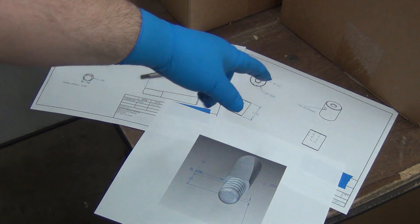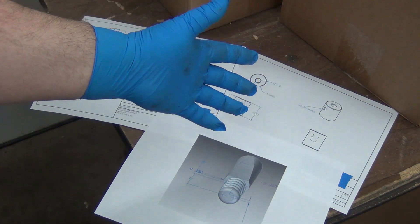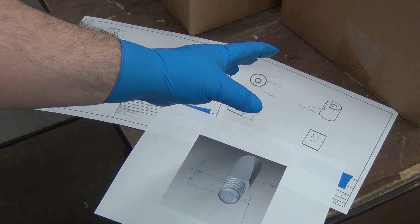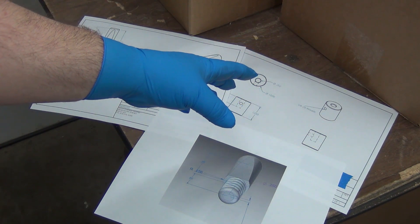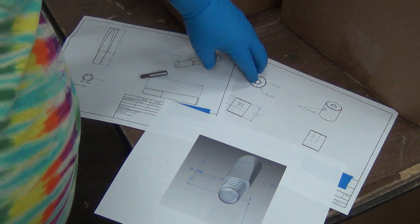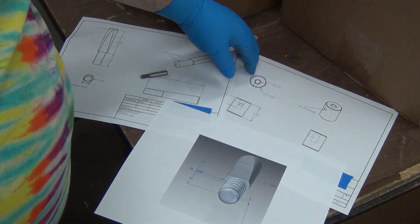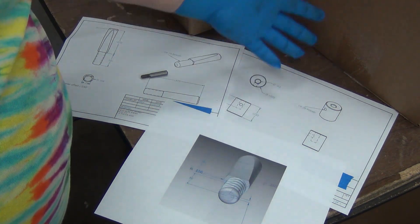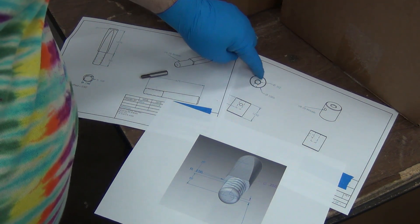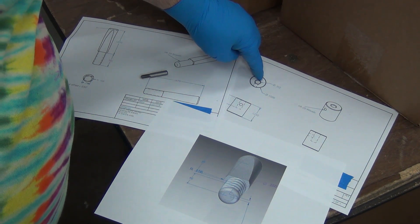What I need is a tool, because I don't really want to keep changing the chucks back and forth. I could put the four-jaw - I'm not even positive I have an independent four-jaw on the little CNC lathe. So I have the tool drawn up here. It's really simple; I'll get it cut to length, clean up the ends on the lathe, and a lot of the dimensions just aren't critical. The offset for the centers I'll just stick it in the mill and move it 30 thousandths.